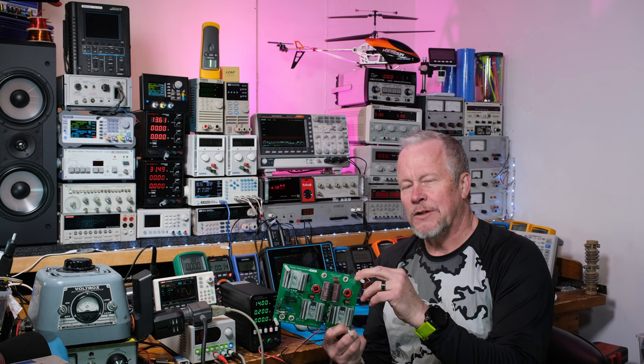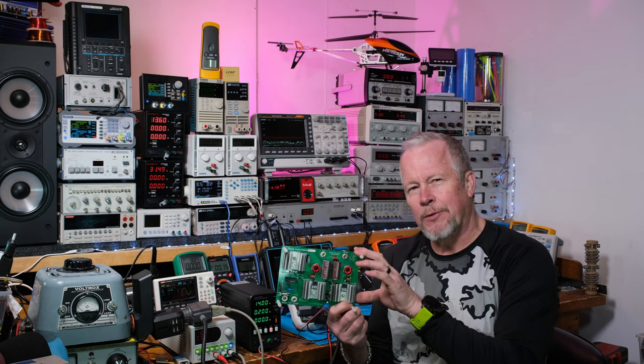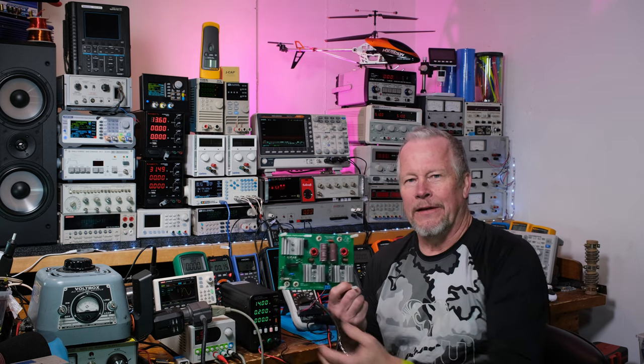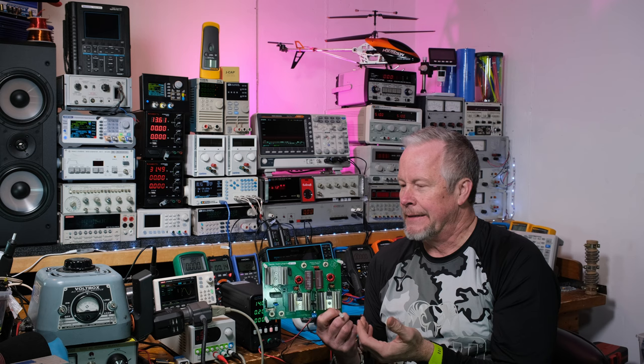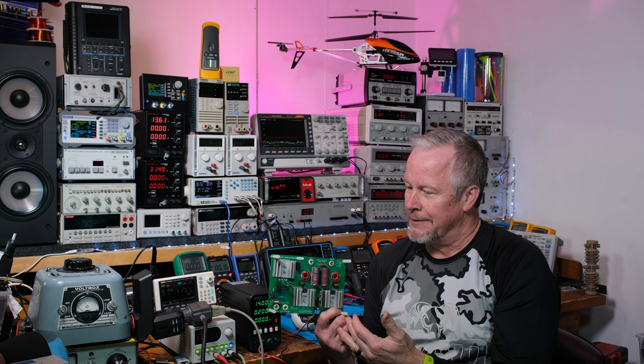This is just the first stage. Then we have to go into a stage where we get isolation and voltage regulation. This one provides around 390 volts regulated voltage, so it doesn't really care what's going on at the input. It'll work on 110, 120, 220, or 240 volts — it's a power factor correction circuit meant for universal input.